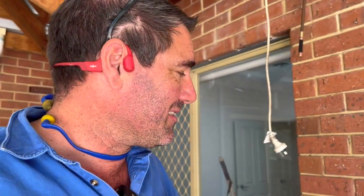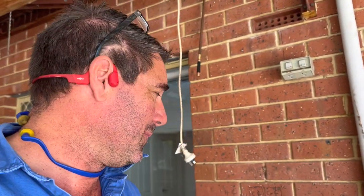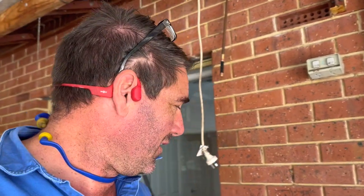If you are doing a new house or anything like that, ask your plumber to set it up like this because it works great. Make sure you get the Rinnai 26 or something like that, which has plenty of water so you can have two showers at the same time. The good thing is that every time you're using the shower, especially on the longer runs, you're only emptying the small pipe, which is really good.